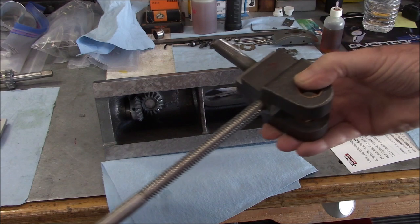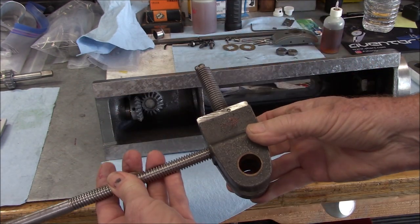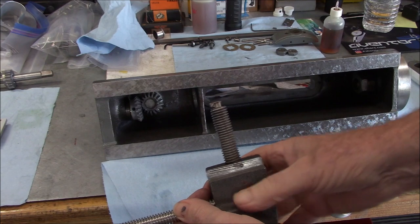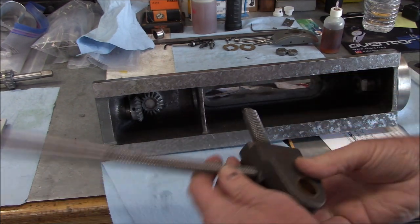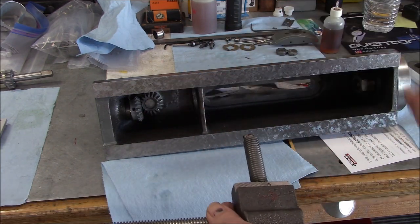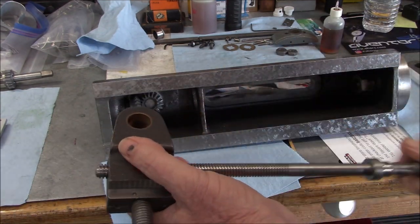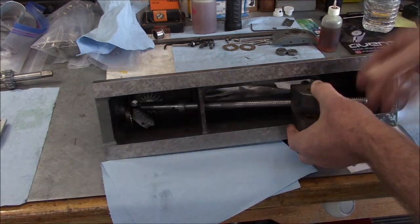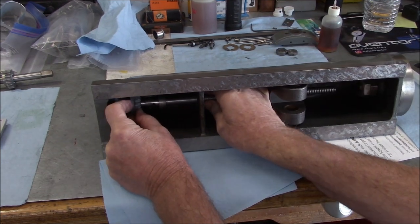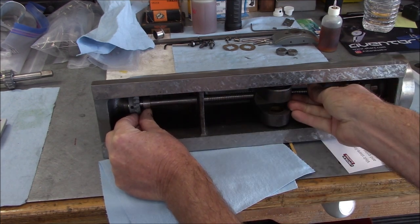Just doing a little dress rehearsal here — so here's the adjusting lead screw, the drive yoke, our gear, washer, and a spacer. You can't pre-assemble this because this gear has to go on the other side of that gear. I had to go back and look at my photos to see which direction this yoke goes. There's a little oiler that points toward the clapper box, and there's a counterbore on this side so they didn't need to thread the whole thickness.